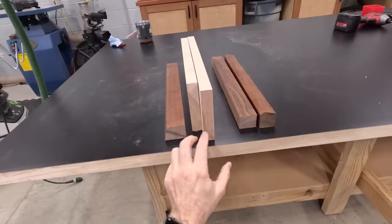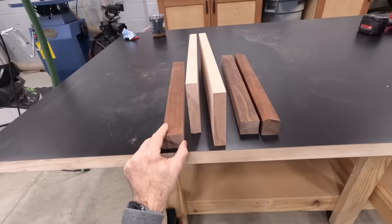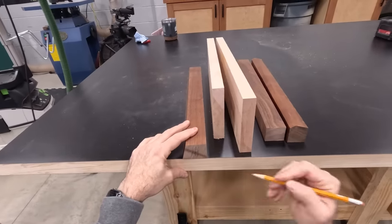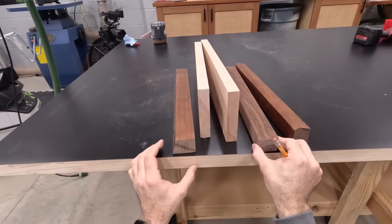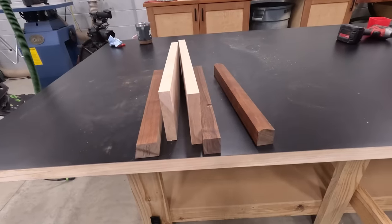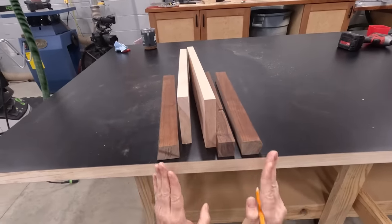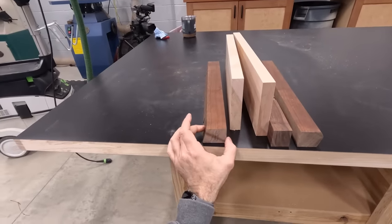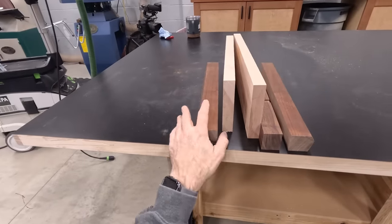When it comes to any long grain cutting board, I'm usually trying to do something very specific with the grain direction. If you look at these walnut boards, this one the grain runs vertical, this one is horizontal — very easy to turn that one and make it vertical. If I run my grain vertically, this is almost like a quarter-sawn board, which is generally more stable. So if I have the option, I'm always going to try to run my grain vertically.